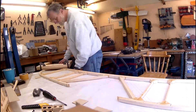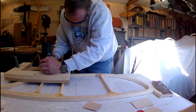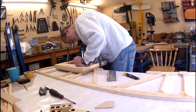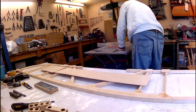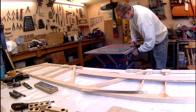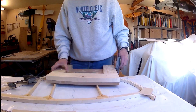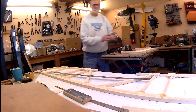Here's the jig in position and I'm starting to do the routing down. Now some people are concerned about the fact that you're taking material away from the wood frame that's already there. But you're only taking in this case a sixteenth of an inch out either side, and that's being replaced by the plywood. The plywood takes the shear loads for the glue joint. The normal glue joint with end grain going onto the side grain of a piece of wood hasn't got much in the way of strength in the tensile line. The gussets take the load through and put a shear load on the glue line, which the glue can cope with a lot better. So they do make the joints much much stronger. The wood joints can cope with compression and to a certain degree a little bit of torsion, but ideally the shear load is the best way to make a joint strong and lasting.